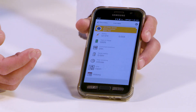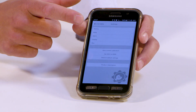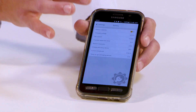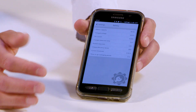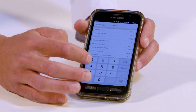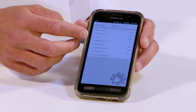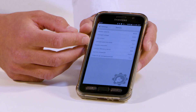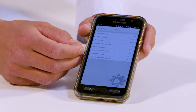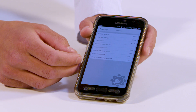It'll bring you to the home screen when it's all done, which shows all the information about your battery bank and your system. To set it up, click on the icon in the top corner, go to Battery. Change battery capacity to 99 amp hours — just click on it, type in 99, and press Done. Then set charge voltage to 14.4 volts, tail current to 4%, charge detection time to 3 minutes, Peukert exponent to 1.05, charge efficiency factor to 99%, current threshold to 0.10 amps, and time to go averaging period to 3 minutes.